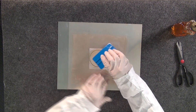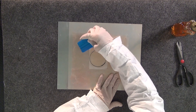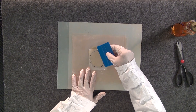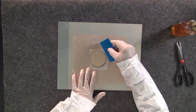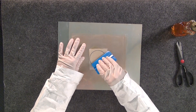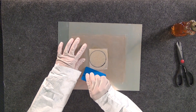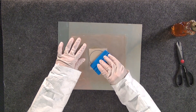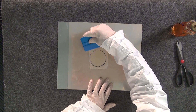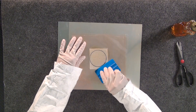The nature of composite repairs is that we want to get rid of the excess adhesive in the cloth. Excess adhesive does not add any strength to the repair — all it does is add weight to the airplane. So I want to slowly pull this out, pulling with the squeegee or spreader. I haven't really applied any pressure to speak of at this point.